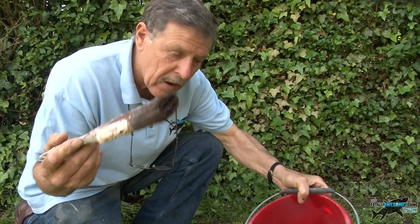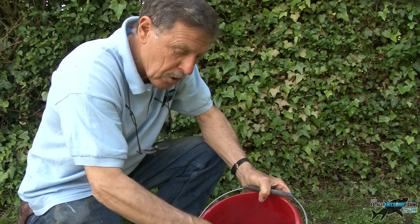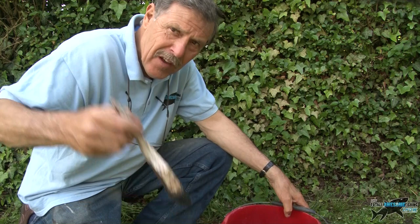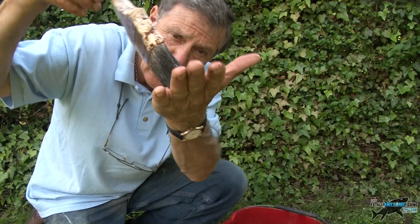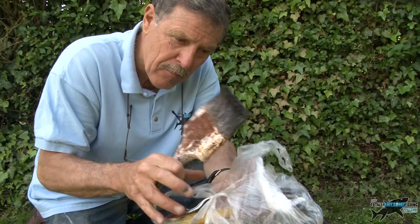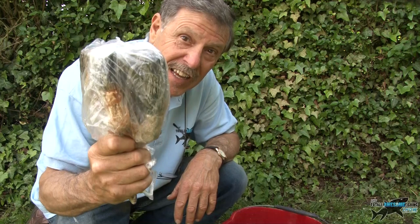There's another tip before you pack up. Being water-based, you can just wash your brushes out with water. But don't just rinse them and leave them sitting flat — the water rusts the handle, and you get a residue of paint that sets and gives an awful finish. Once washed, wrap the damp brushes up in a plastic bag and they'll be soft and ready for the next session of fence staining — hopefully not for a year.